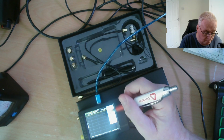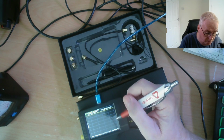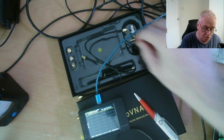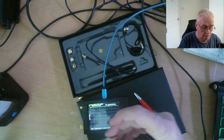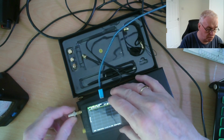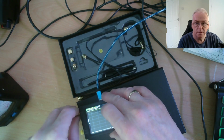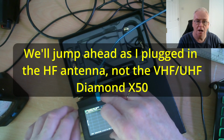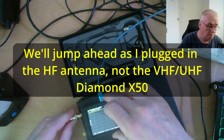It does. These are previous calibrations I've stored. Now we're currently on this one, so that's fine. Now we can do some measurements. To do measurements, I'm going to have to connect it to a BNC antenna. Now I know that's not ideal because you really want it on a little short wire. But when you're doing this type of measurement, that's going to introduce a time delay, which is going to muck it up. I did say muck.